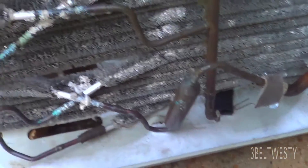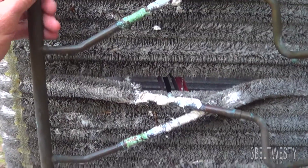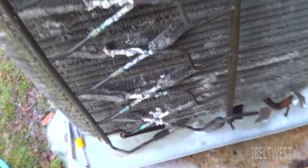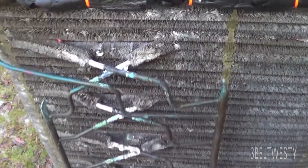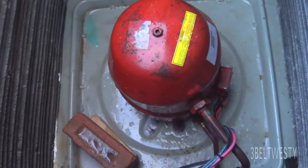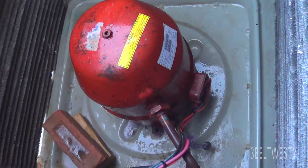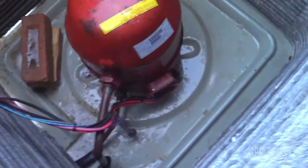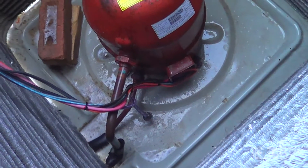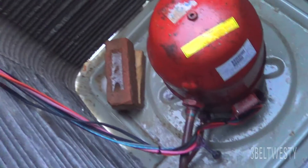So I'm going to pump this down and see if it works. It's been a pretty good unit. These wire ties here — the little rubber piece tends to break off. Right now I've got the side off the compressor at the junction, because the megger on it had some issues. But I ended up cleaning up the connector area and it tends to meg fairly decent now. So I might be able to resurrect this thing.